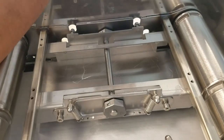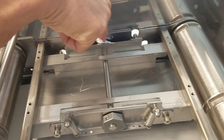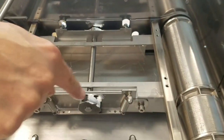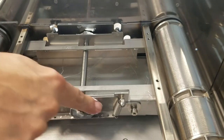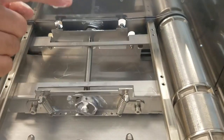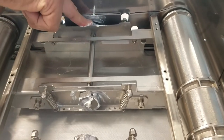Take the second set screw and apply a small drop of loctite and completely insert it carefully into the cam. Apply some high temperature food grade grease onto both cams around their entire perimeter. Rotate the compression knob to help lubricate the mechanism and ensure that it's fully functional.